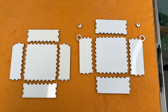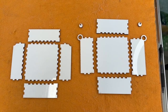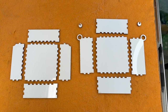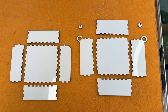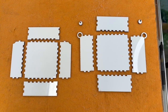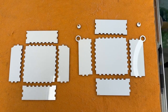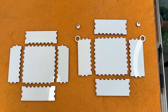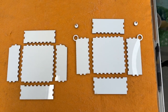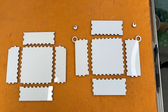We'll collect our pieces off the laser, lay out the box, make sure we've got all the pieces, then fit them all together using blue painter's tape to hold it while we verify everything works. I don't usually glue the individual pins — instead I put a seam of 2P10 (a commercial-grade CA glue) along the perimeter and spray some activator on it. That's a lot quicker and works very well.